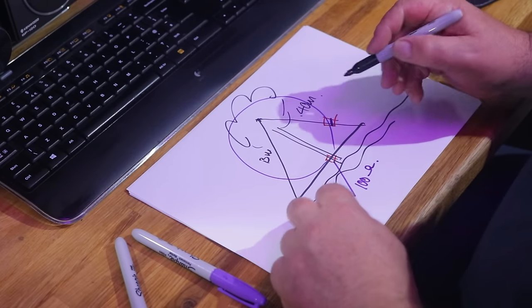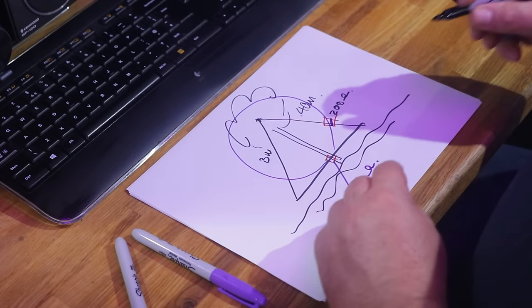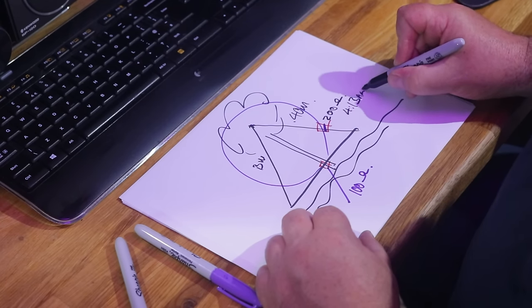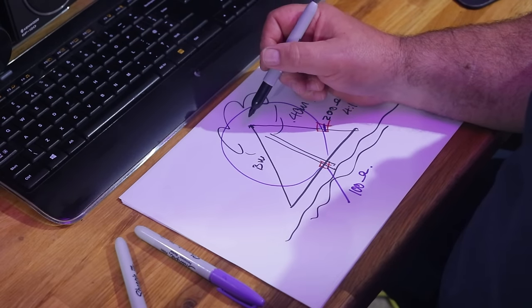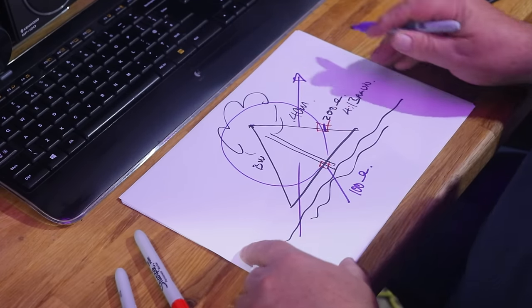Feeding a quarter wavelength down from the top, the impedance at that point is somewhere between 150 and 250 ohms — we'll call it 200 ohms. There are a couple of options here. You could use a 4:1 balun, which you can buy for about $40. There's a little bit of loss in there but not too much, and that will allow you to connect your coax straight to this setup. So if you've got a big tree out back you could do this. The radiation pattern then goes kind of through the middle.